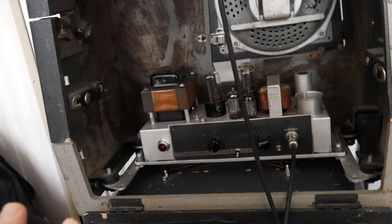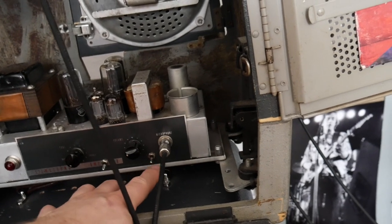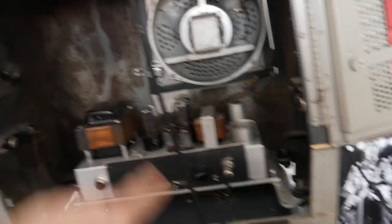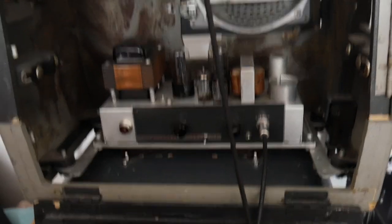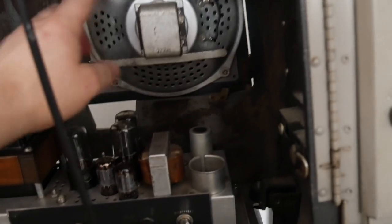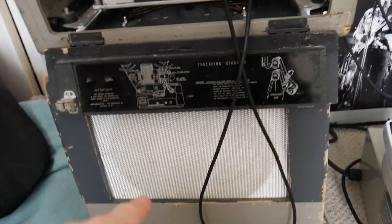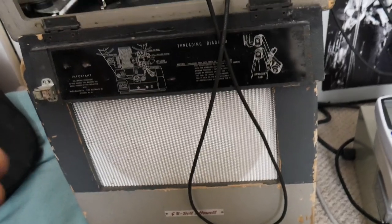This first one is a 6V6 1950s projector amplifier. We've got two little switches — the first is a preamp boost, and this is an EQ selector which I normally have on high to give more chime. You've got two 6V6s, two 12AX7s, and then a rectifier tube at the back. These compress really beautifully — very hi-fi, just a great sound. It came with an eight inch speaker but this one's connected up to a Celestion 12 inch Type A speaker, which is relatively cheap but gives a robust, neutral sound that I like for live use.